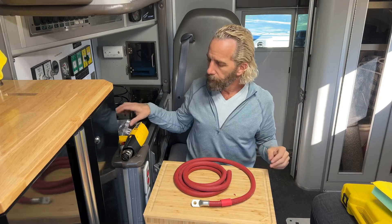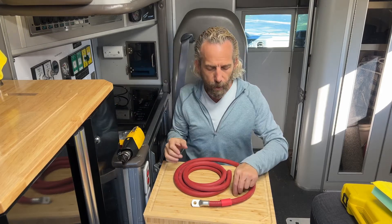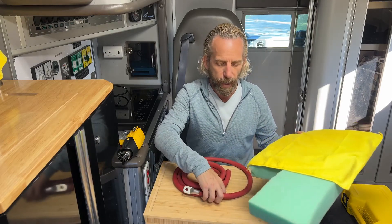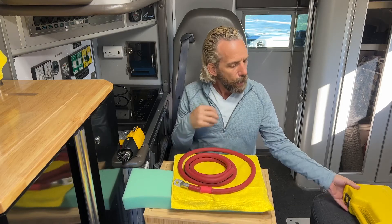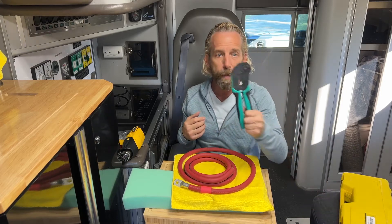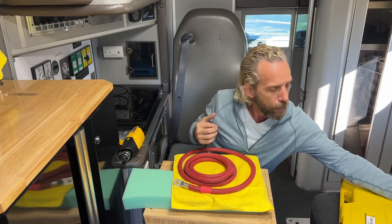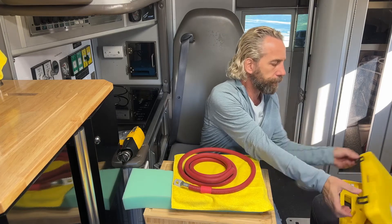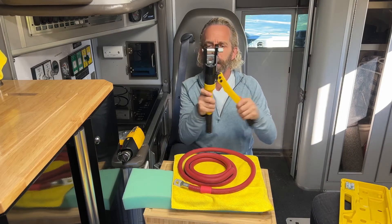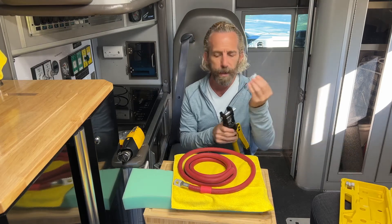Slide the terminal on and it looks good — if you didn't cut enough off, go back and take another eighth of an inch off. That's step one. Now for the third crimping tool: we had the small one for small wires, the middle one for medium-sized wires — those are for ferrule tubes. This large hydraulic one works by pumping. There's a knob that says open and close, and there are different dies that make a hexagon shape over the wire.